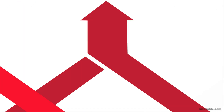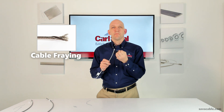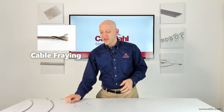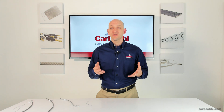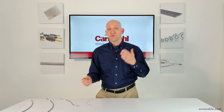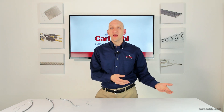When handling and cutting tungsten cable, there are three potential issues. The first is that the cable can fray, like this here. When cut, the wires begin to unwind and spring open — in some cases you can double the diameter or more. If you only have a thousandth of an inch of clearance, the cable would be completely unusable. You'd have to recut it, or if there's not enough material left, throw away the cable and start over.